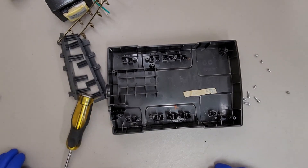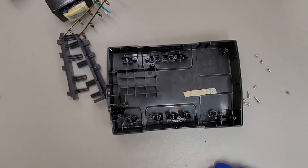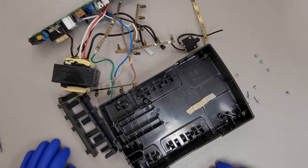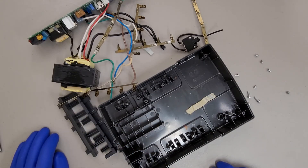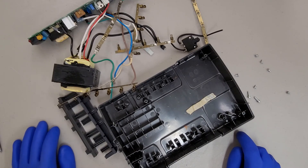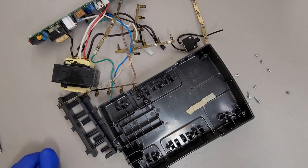There's a lot more going on with your more commercial-grade ones — especially some of the higher-end ones that are active battery backups, where it's actively running off the battery and the line voltage is keeping the batteries at the appropriate voltage. That way there's less switchover time if there's a power outage, because there is a brief switchover period. It's not long enough to disrupt most things, but when you're dealing with higher-end battery backups for large server farms, they can't afford to take the chance that tiny switchover time is going to disrupt something. Hopefully that's interesting — thanks for watching.